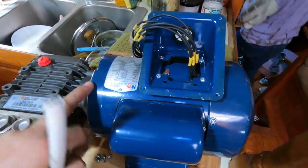And then the instructions tell you, and there's also a tag here if you're running it for 110 or 240. This is just a standard AC motor, so depending on how you wire it, you can wire it for 110 or 240 single phase. So it's not super scary to do, but I'm going to show you what I'm using. This being 110, you could use house wiring.